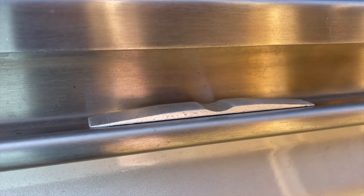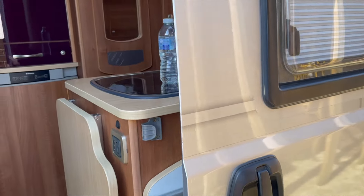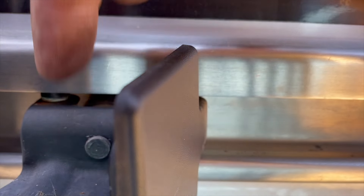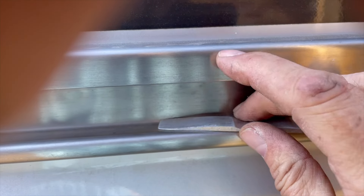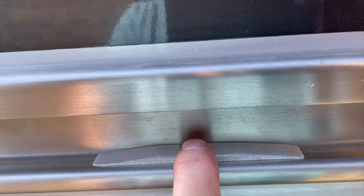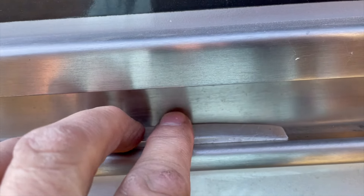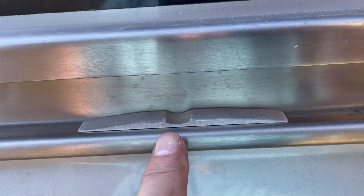To find the right position for your device, just move your door to the place where you think 'right, that's where I want it to stop' — for me that's about there, level with the front edge of the kitchen cabinet. Look at your track, make a mental note of where the middle of the roller sits, then move the door out of the way and place your device in the track — it's that simple. You can obviously mark it with a pencil, and you're going to be attaching this with some double-sided foam-backed tape, the thinnest stuff you can possibly get. Before you commit to sticking it down you can test your device — it won't move around too much.